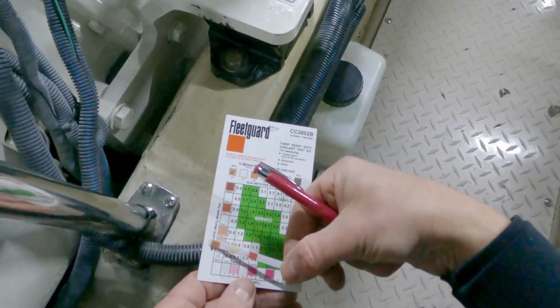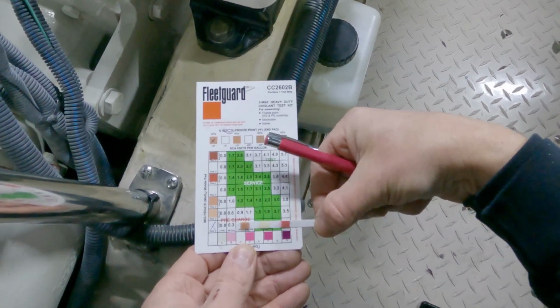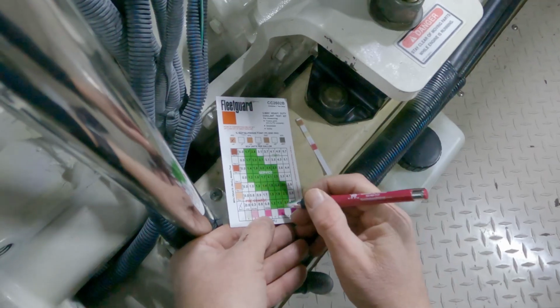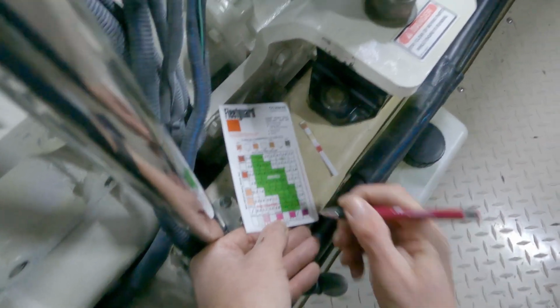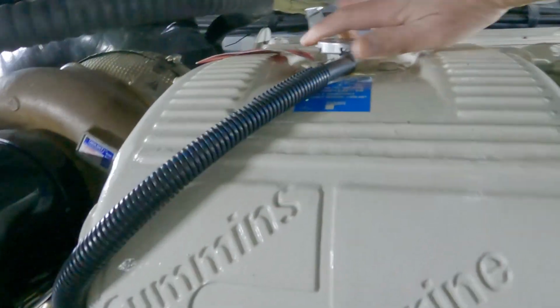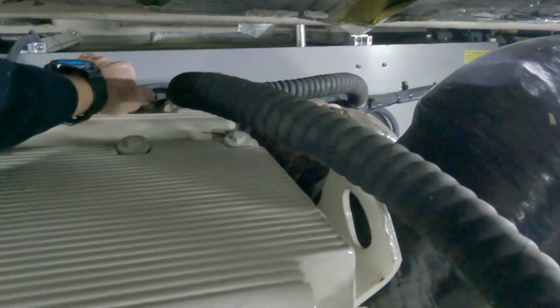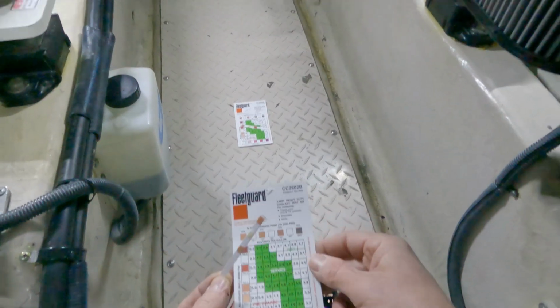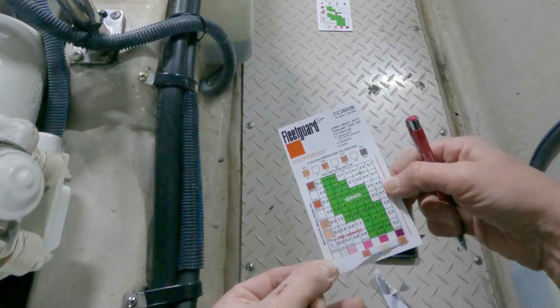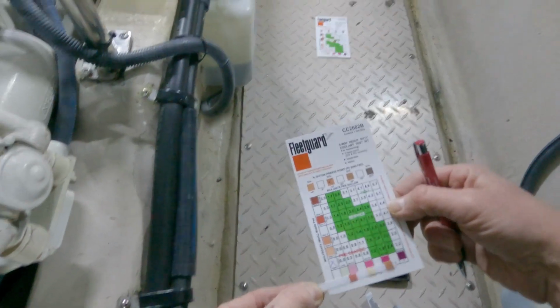Coolant testing ensures that the engines are protected internally from pitting and corrosion from improper supplemental coolant additive levels, and that the freeze points of the coolant in the system remain within the proper levels, all of which is designed to help protect the engines as the coolant naturally breaks down over time and between changing cycles. It was all new to us, but thankfully everything checks out.